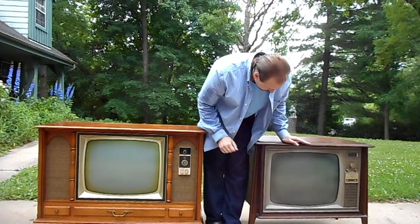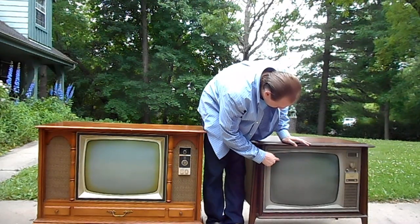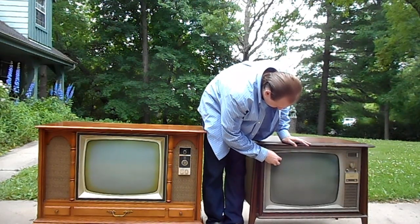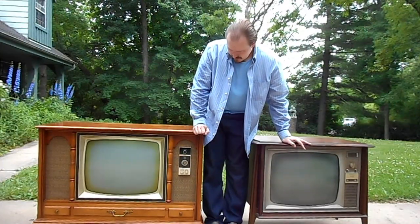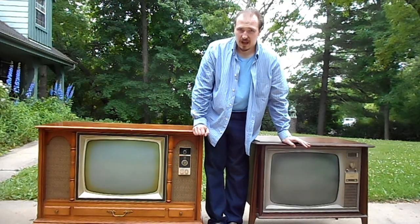RCA tubes, on the other hand, tend to turn a black and or white, moldy, speckly color at the edges. And this is a close-up of what an RCA style cataract looks like. Both of these will be fairly noticeable when watching programming on the set. They're both the same material, but they were mixed, I believe, in different ratios and degrade differently with age.